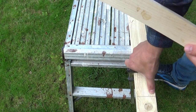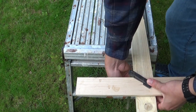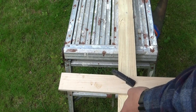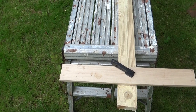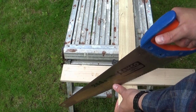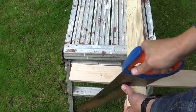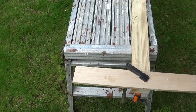Small tip: if you're having problems cutting straight lines, try drawing a straight line across the wood, then take a scrap piece of wood, clamp it down, and use it as a guide — it will give you straight cuts every time, most of the time. You're better off using a thicker piece of wood as a guide, as it's less likely to create a small bevel in the back of the wood as you're cutting.